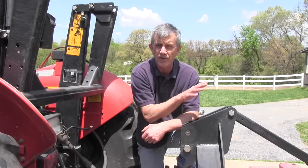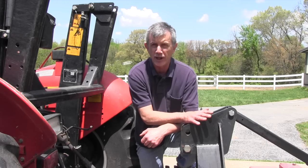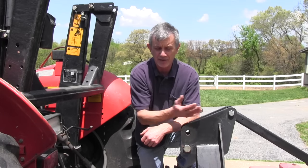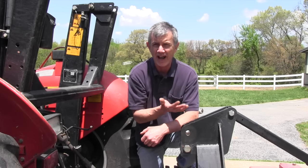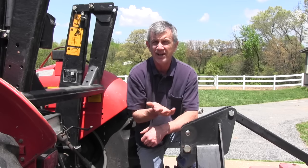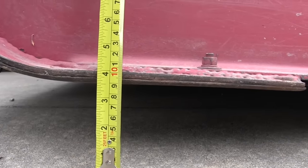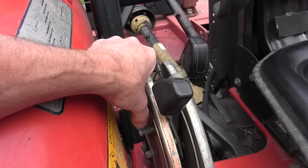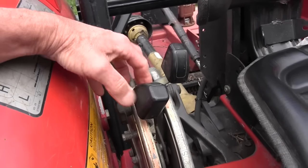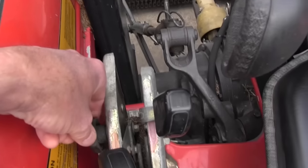What the owner's manual on this particular cutter told me to do is first set the height. The blades are an inch above the skid plate on the bottom of the brush hog. So if I want to mow at around four and a half inches — which gets me above most rocks, doesn't let me scalp the ground, and makes a nice cut — I'm going to put the skid plates at three and a half inches off the ground, since the blades are another inch higher. Once you get your height set at the skid plate, come around to the tractor operator area where you can set a stop that restricts how far down your lever goes.